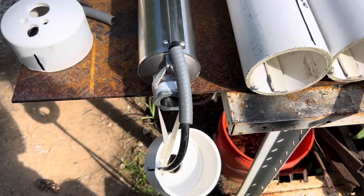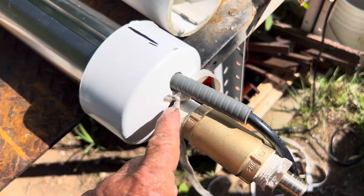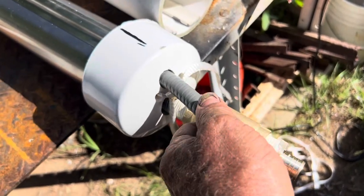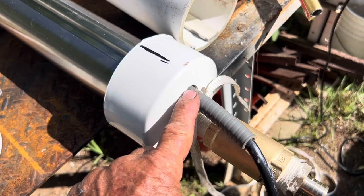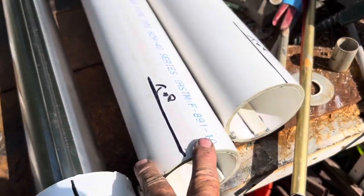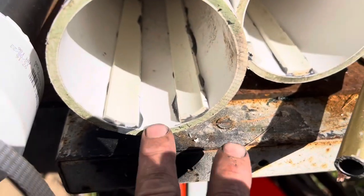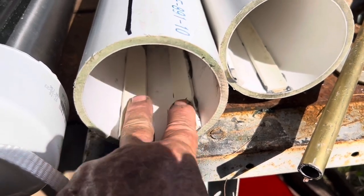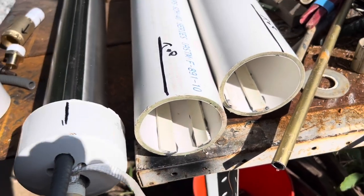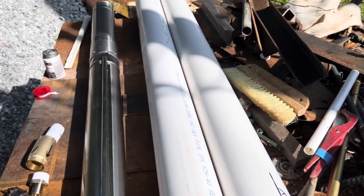Here it is — this piece of pipe, the pull strap ties on to hold the pump, and this piece of gray flex conduit protects the power cord. All of this slides down this piece of 4-inch PVC pipe, and what I have in there are two runners glued in — just strips of plastic cut on a table saw. The pump's going to sit right here on the bottom. I got the top marked so once I got it together I know where it is.